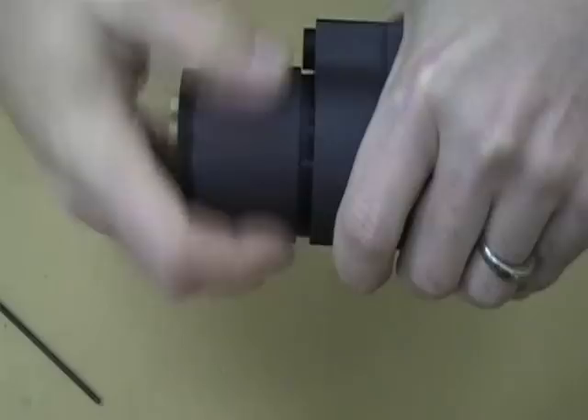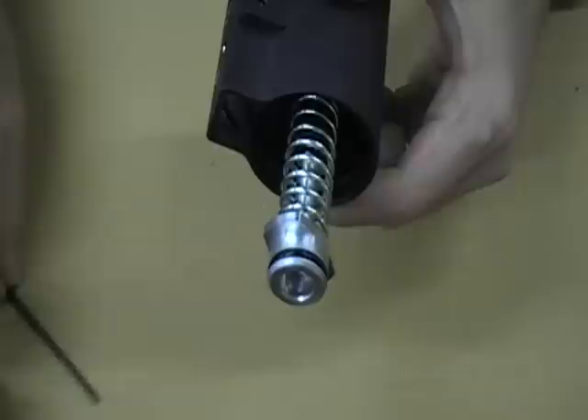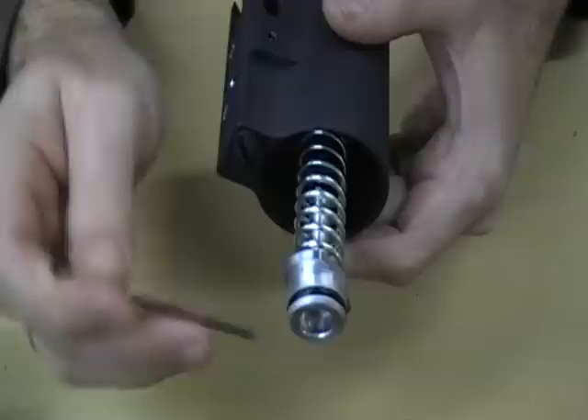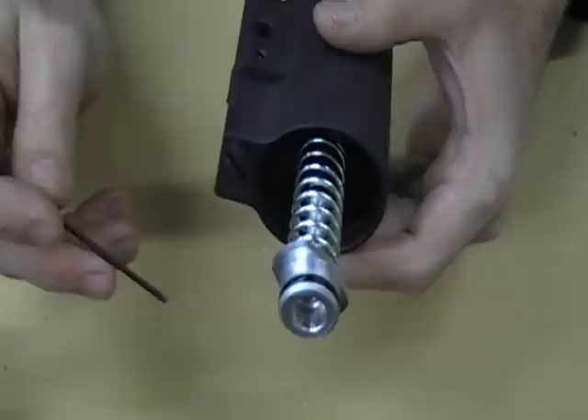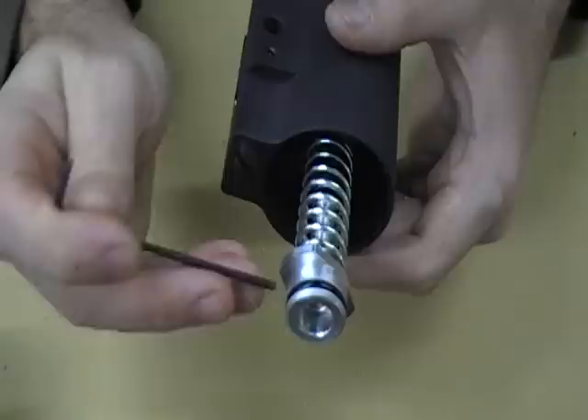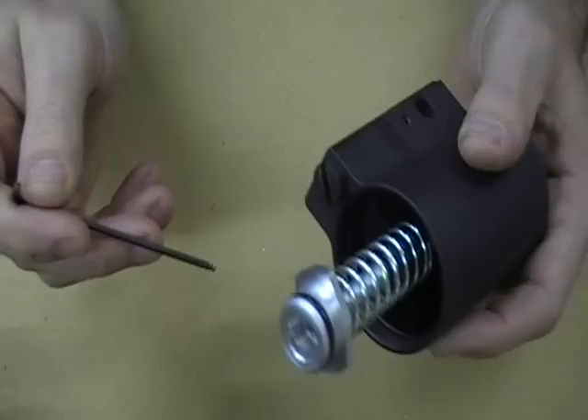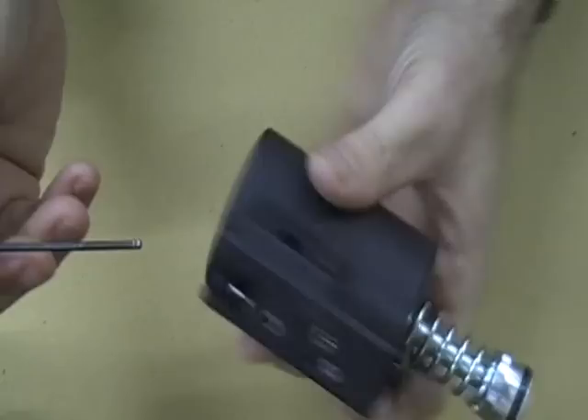This unit can come apart here. This will show you the internal piston, or the main piston, where you'll see a couple of o-rings and then there's one inside this spring. All of the o-rings on the unit, after a 20-hour period of use — which will give you a ton of lifetime if you do it on a regular basis — you want to coat with Vaseline. Just 100% pure Vaseline with no additives, and this will keep your o-rings in great working condition.